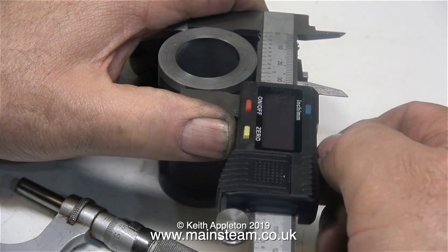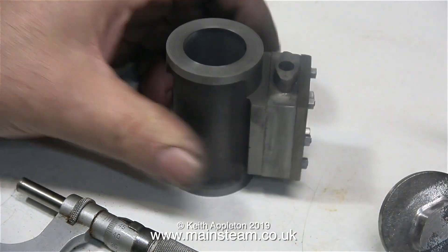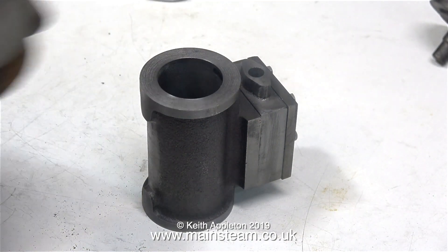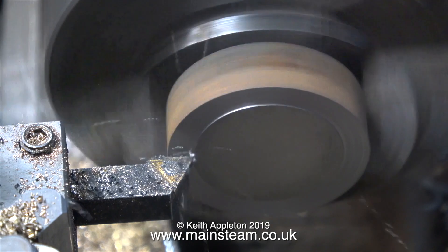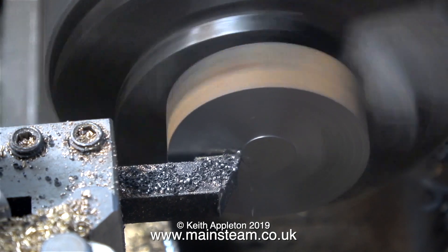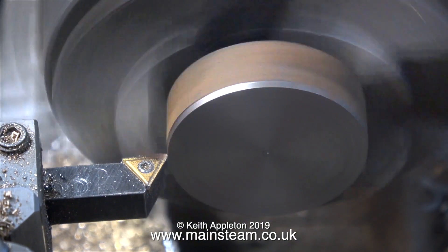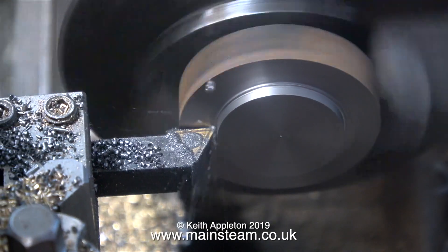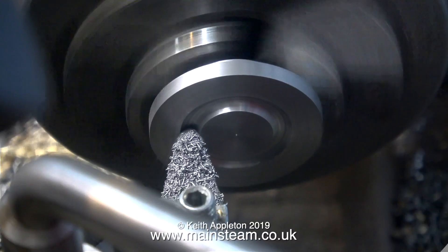As well as a sharp piece sticking out of the side, there's also quite a lot of sand stuck on the shell, but after a few minutes using my one-inch belt sander the casting looks much better. I don't need any electrickery whatsoever — I just need to set the caliper to the same diameter as the end of the cylinder. This piece of cast iron bar is far bigger than the end of the cylinder, which is a good thing — better to have too much than too little. Over to the lathe: I've clamped the piece of cast iron in the chuck and I'm facing it, which means running the cutting tool across the front face to make sure it's square.